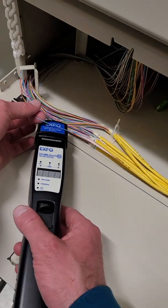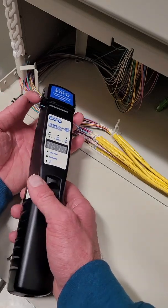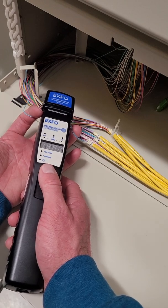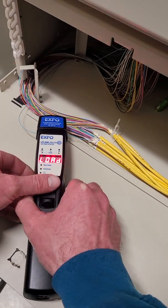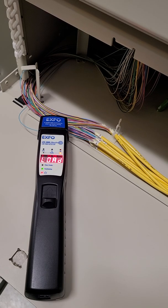Here's what it looks like when you clamp onto an active fiber. Slide the fiber between the channel, hold it back with two fingers on each side, clamp down, and close the cover. It's important to close the cover because that helps eliminate sunlight or light from the room coming in, because it actually throws it off.